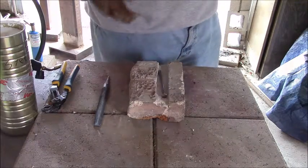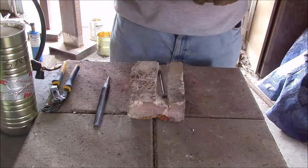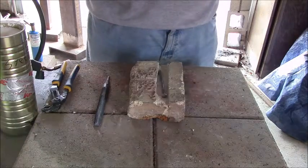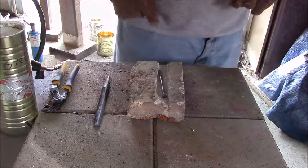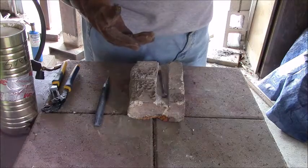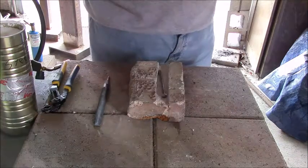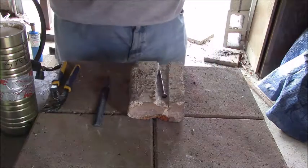This nail also allows you to use a little bit smaller torch because it's not radiating as much heat. On the nail you don't have to worry about plastic parts. With a file, if it had a plastic handle on there, you need to make sure it's all off so you're not giving off poisonous fumes. We're also counting ourselves lucky that we are not dealing with aluminum, because with aluminum, as you're heating this end, all the heat is going racing down, making it harder to get up to temperature — it's just radiating and not getting up to the temperature we want for annealing. With steel it's a little bit more forgiving; the heat stays a little bit more where we want it, so it is easier. One of the reasons I prefer annealing steel to aluminum.